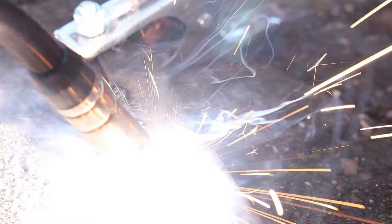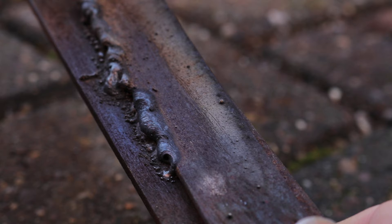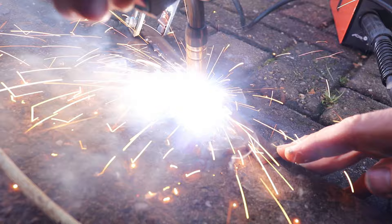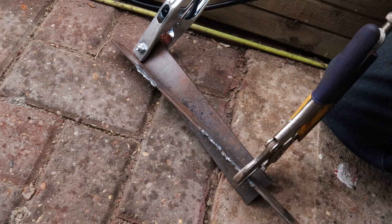At 200 amps it's a lot better, but I haven't really penetrated into the lower piece of metal which is the 4mm thick. I actually think my welding's a bit off and I'm not getting into the seam correctly. I'll try butting the two pieces together - now that's much better. You can see it's run a bead down but there's not a great deal of penetration with these thick pieces of metal. They have stuck together though. They'll be much better with slightly thinner metal. So with the same pieces of metal I'll use it on MMA stick welding - you should see a noticeable difference.